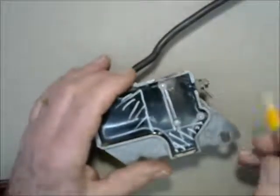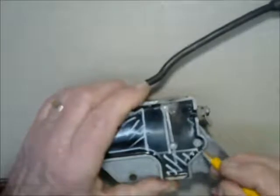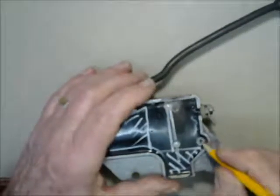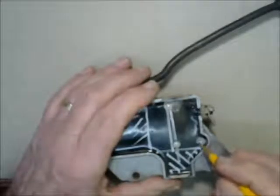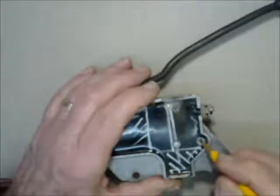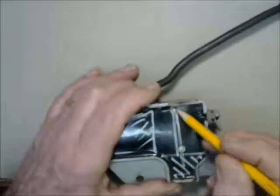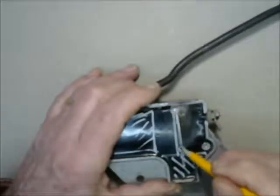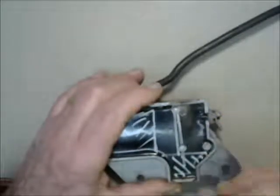When I remove the epoxy it turns out there's a screw right here in this little hump part, and on the other side you can see the bottom of the screw. What we can do is just drill through the epoxy down to the screw to get an idea of how thick the epoxy is — it's not going to hurt anything because it's just a ground screw. I also drill a hole at each end, since the easiest way for me to remove material is to drill a hole. I drilled a hole at this end and at this end, and I want to remove a strip of the epoxy in this area.